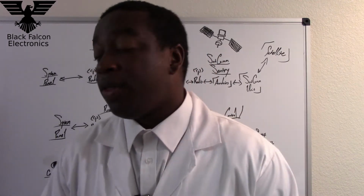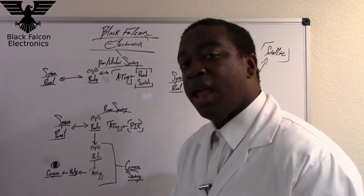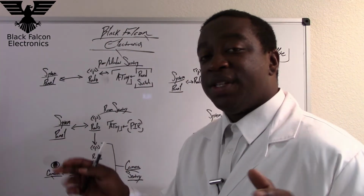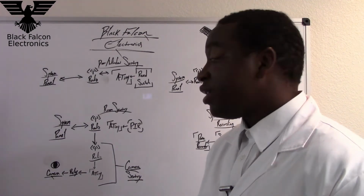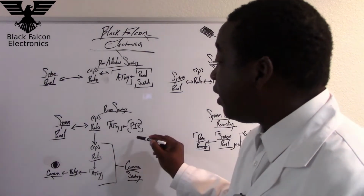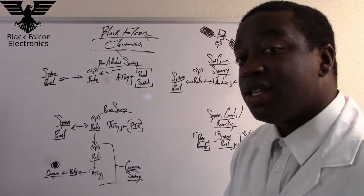So when I activate the Room Sentry, the PIR obviously turns on, and it has about a 1 minute warm-up time from my experiments. And from there, it'll constantly be watching for a difference in state in the room or whatever area it is watching. So when it detects someone walk in, anyone walks in, it sends a high signal to the ATtiny, which reads that state, and from there sends information to the radio.